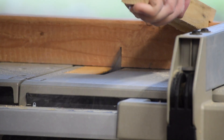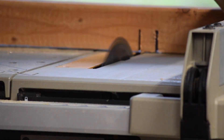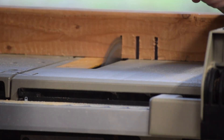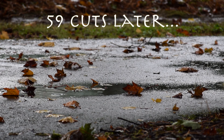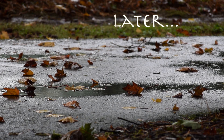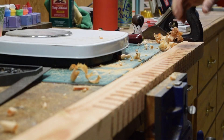Next was cutting the slits. Without a better method available, I used the table saw. Not having a crosscut sled and dado stack, this meant many parallel cuts by hand. The depth of cut was kept as close to the center line as possible, which would allow the string to be pulled as vertically as possible without putting any additional torsion into the bow.